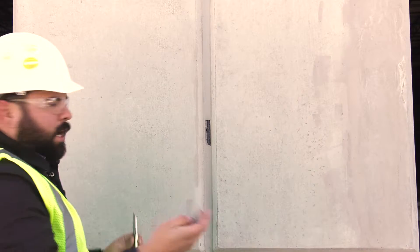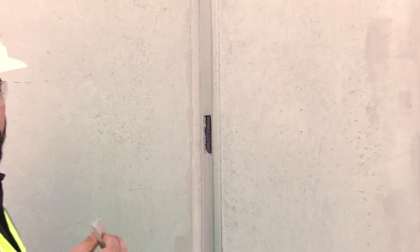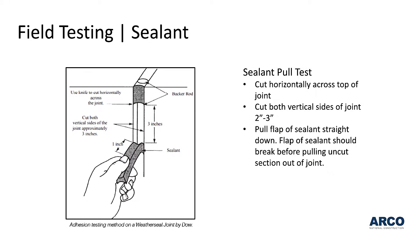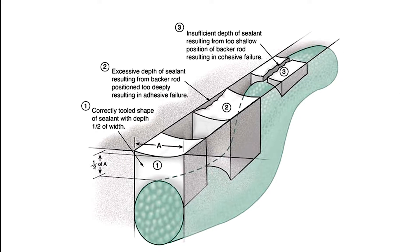You can see how the caulking broke at the bottom of the slits. This caulking has been installed properly and it is bonding properly to the concrete. After the pull test is complete, it is also good practice to visually inspect the pull tab to ensure the depth or thickness of the material is half the width and never more than a half an inch deep.